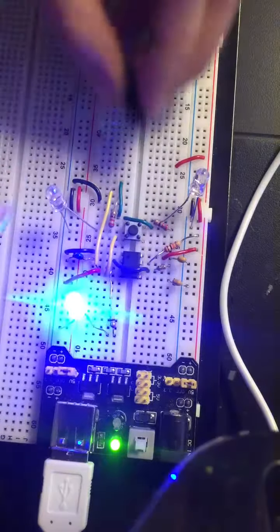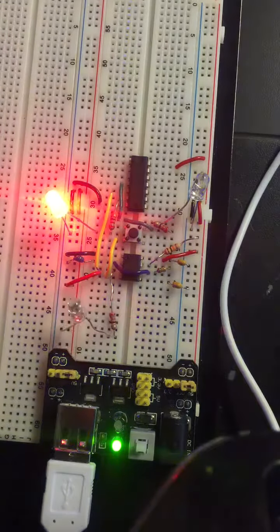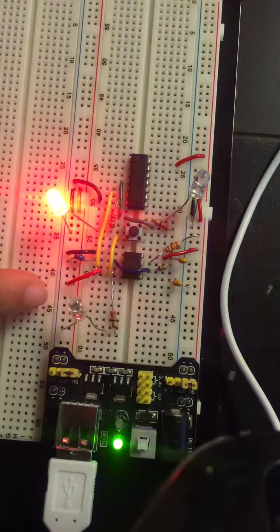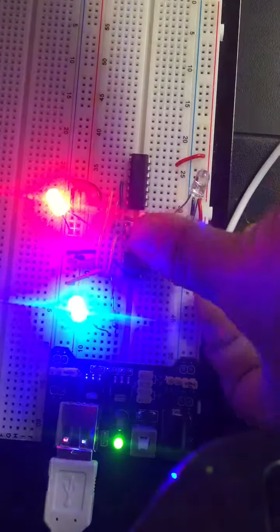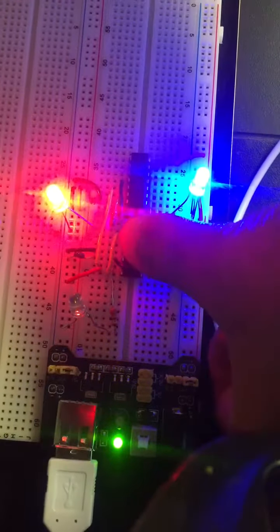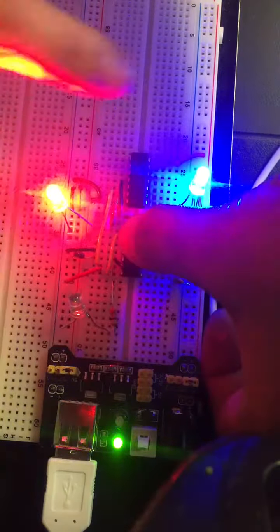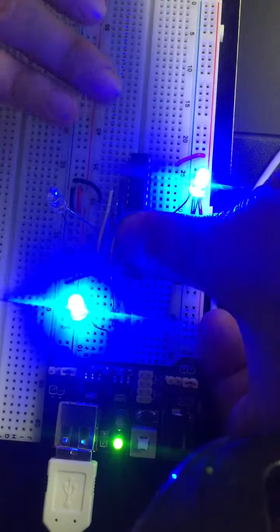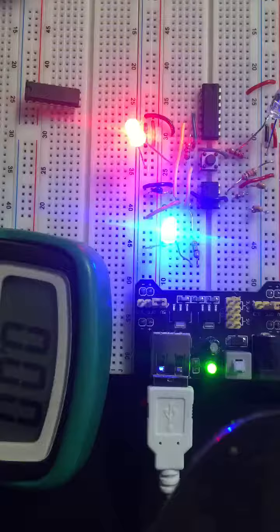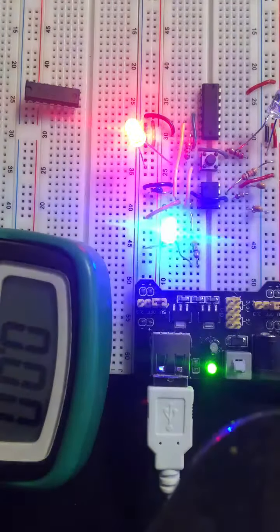And so, okay. And so we see that it's a 1 when there is either no inputs or there's only one input. So we can check what it is when there's both inputs being a 1. So we can see that whenever both the clock and the push button are outputting 1, there is no 1 from the gate. But whenever there's no input or only one input, the gate outputs a 1, which means it's a NAND gate.